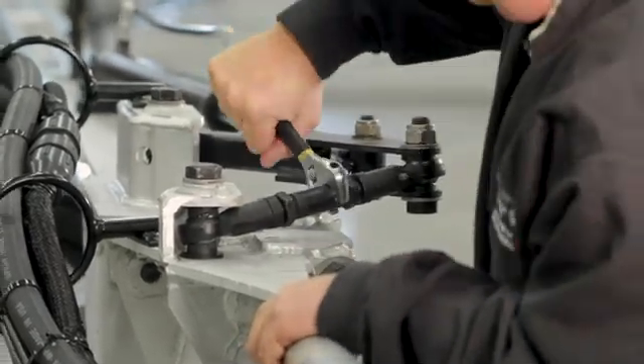The last step is to grease the entire boom. There are eight grease zerks on each boom wing — one at the breakaway. There are also seven grease points at the hinge: one, two, three, four, five, six, and seven. There are also two grease points on each fold cylinder, here and here.